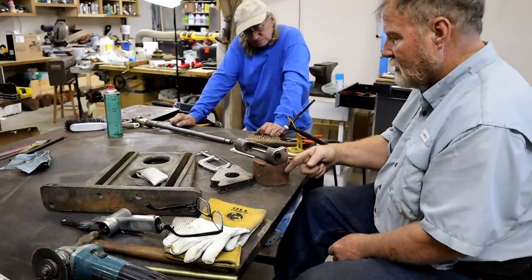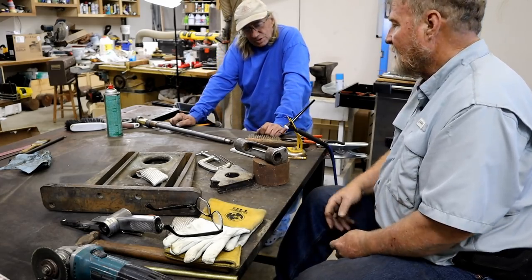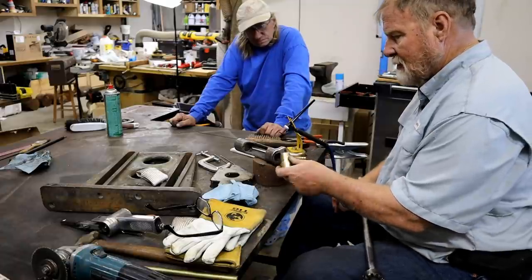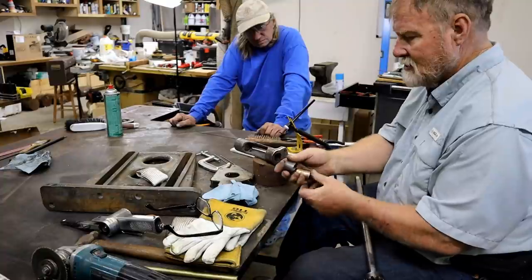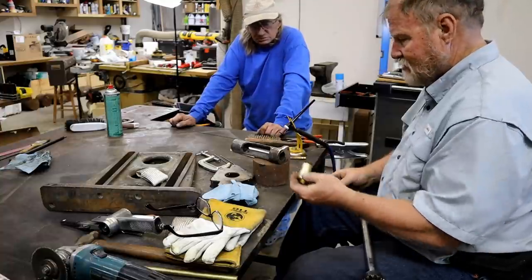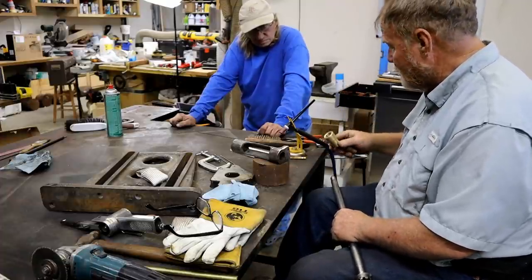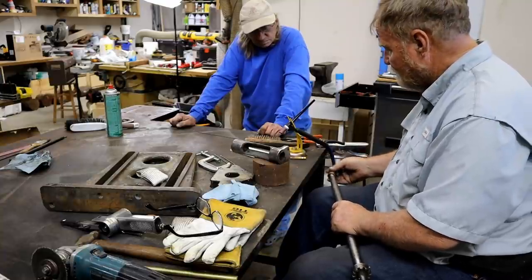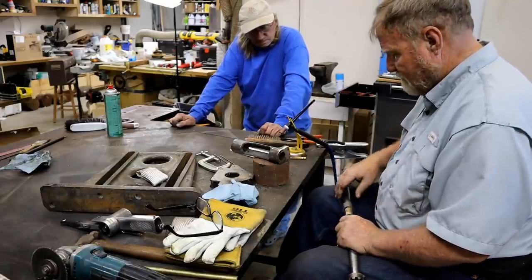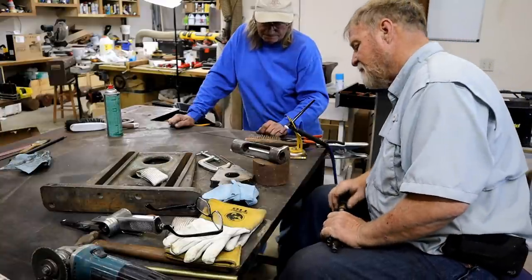You're going to put it on a mill and mill this face flat. Yep. And then counterbore that and re-drill the hole there. This new piece will fit in there and stick out to take the place of this and this. So that ought to be just as strong. And if this brass, which I don't know, mystery brass, whatever it is, if it's not strong enough and wobbles out too much, you know, see there's the same fit. Think you'll be okay? Yeah, I think so. Not better than it was. You can go home and paint this.